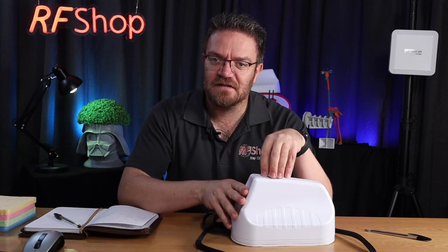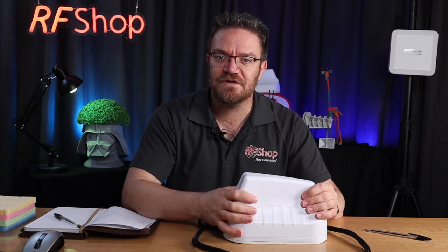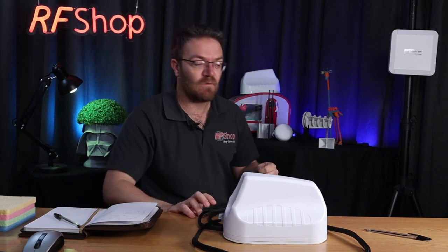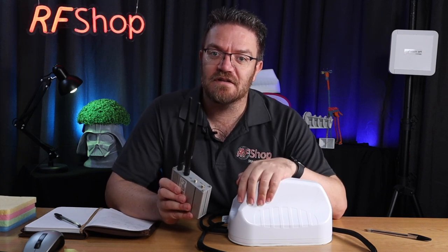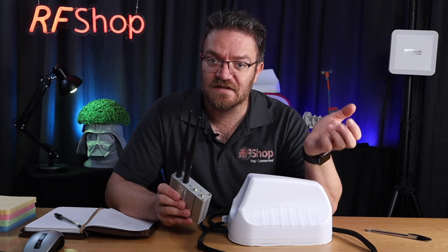The 4x4 has four 4G/5G antennas in that form factor. The dash-15 has five elements: two 4G antennas, two Wi-Fi antennas, and a GPS antenna. So on something like a RUT360, which has four antenna outputs, you could connect two 4G cables to the 4G ports and two Wi-Fi cables to the Wi-Fi ports, as with the dash-15.